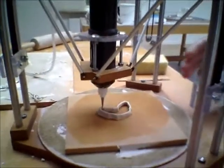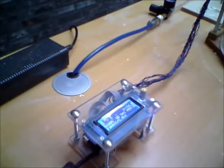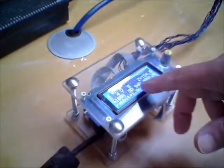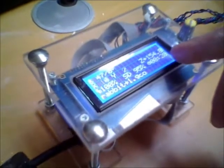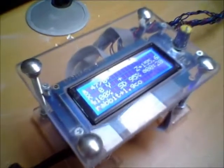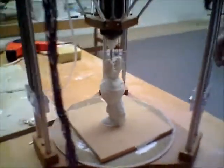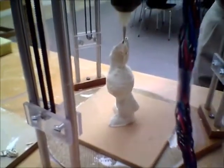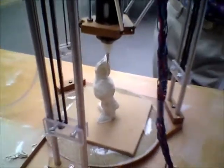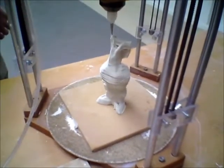If you've got quite a complicated form that starts leaning in or out you'll start using the hair dryer. So here we've got a readout — you can see 94–95% of the print has been done and it's been running for 20 minutes. That's the name of the file that we're printing. Now if we go back to the print, we're very near the top. Obviously the flow keeps going, so as the print finishes you want to just withdraw the extruder out of the holder. We've had the hair dryer going on this.